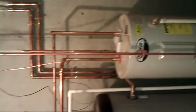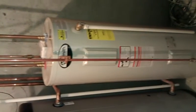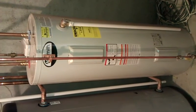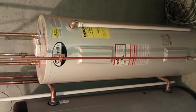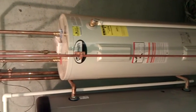This is the air exchanger. It gives you an air exchange per code in Minnesota for the house. This is our preheat tank. Again, there's no electricity or gas hooked up to that tank. The geothermal will heat that tank as long as there's a calling for heat or air conditioning. We'll heat that tank up to 130 degrees with a long enough runtime.